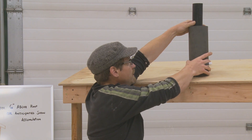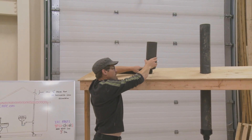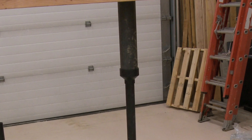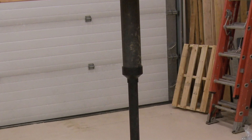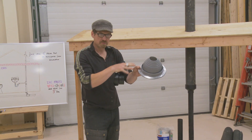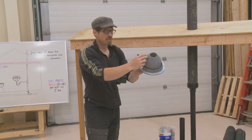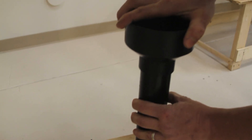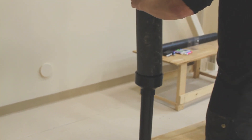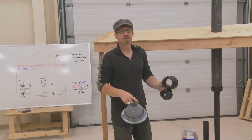You can also purchase a prefabricated insulated stack cap that goes down over the vent. The next option is enlarging the stack, which is a relatively simple process. This style is designed to conform to a metal roof; another style is a flat metal plate designed to work into a shingle system. Almost all of these have adjustable rings you can cut down to make smaller. It's simply a matter of resizing the boot and adding an adapter — you can go from two to three inches or from three to four inches, and all variations in between.